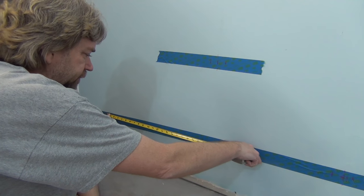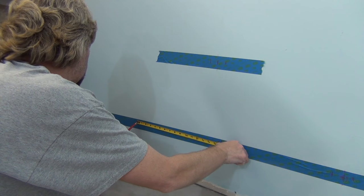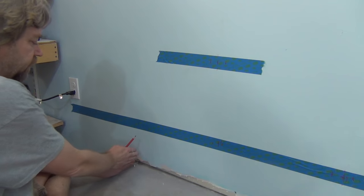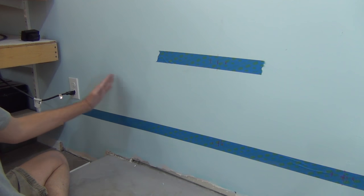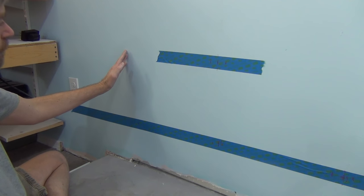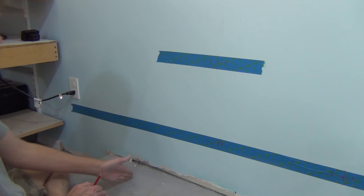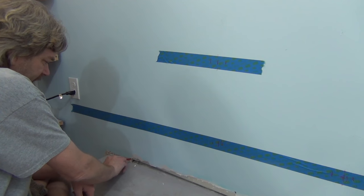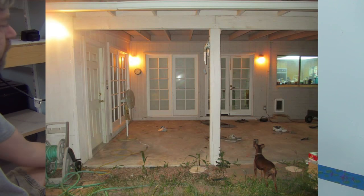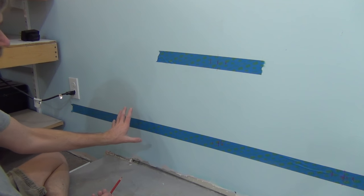Going over 16 more inches, this is where it gets interesting. If you can see from the concrete right down here, this is all new construction from this side over — and the other side is old construction, the original wall of the original train room area and exterior wall. Then they put the addition on in this direction. You can actually see where it begins and ends — this concrete is fill. So right here roughly where that little notch is, that's the trade-off between the old and the new. It's going to get peculiar in this area to find a stud.